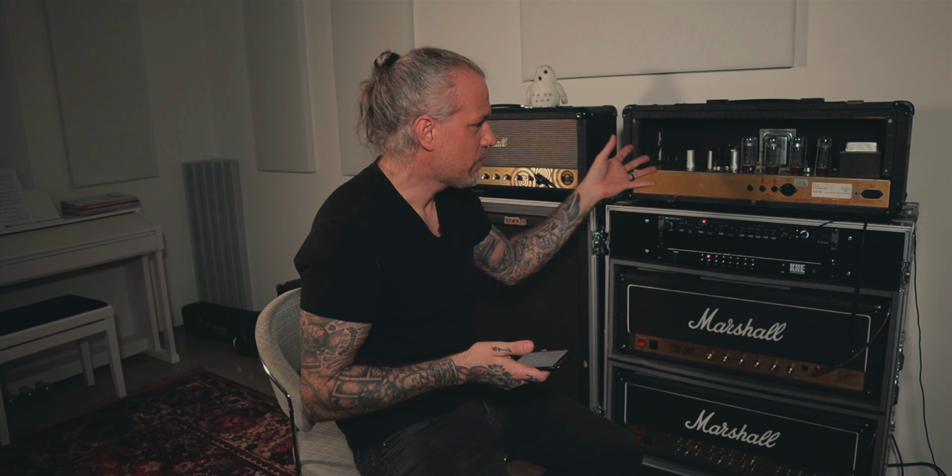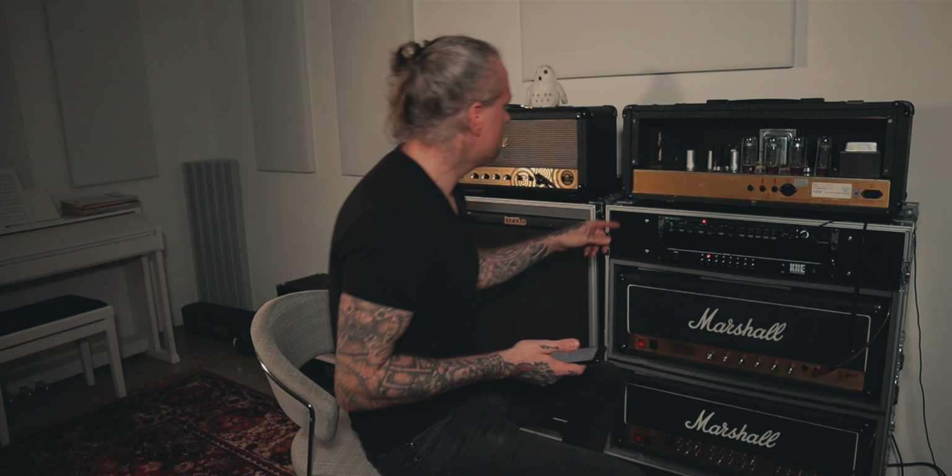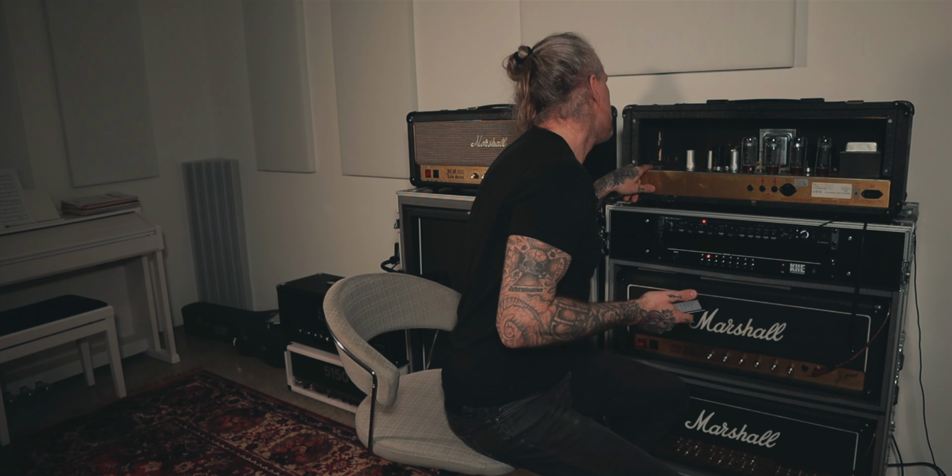And as most of you might know, when the preamp is cranked, the effect of the bright cap is quite non-existent. When you back down the preamp gain and the master, then the effect of the bright cap becomes quite audible. I will show that to you later, but the way I use these, they're pretty much cranked, so the difference is a little bit smaller, but there is, since this has always sounded a little bit more aggressive.